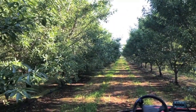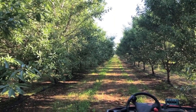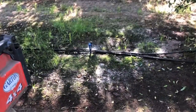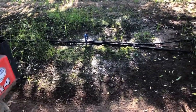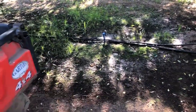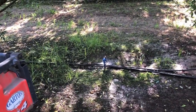We're driving along the center of these rows looking at both sides watching the sprinklers. We can see in our peripheral vision if a sprinkler is not working right — either it stopped completely, water barely trickling out, or there's a steady stream shooting out of it. Or like this one: it's still spinning but I can tell it's not putting out the rate it's supposed to be doing. It's kind of a weak flow right now, so I'm going to change this sprinkler. There's probably a very small piece of sand or something stuck in it causing it to not reach its full volume. That's basically what we're doing as we drive along — looking for sprinklers that are messed up.